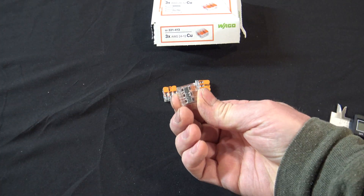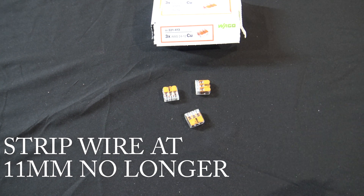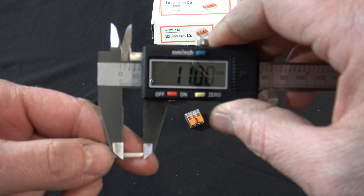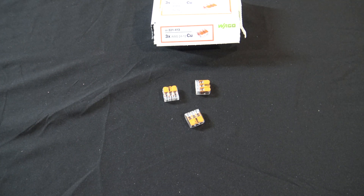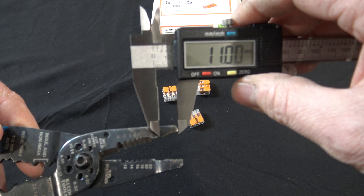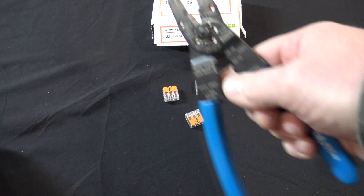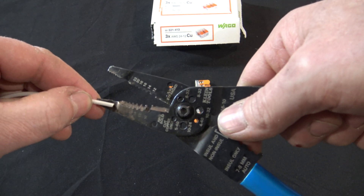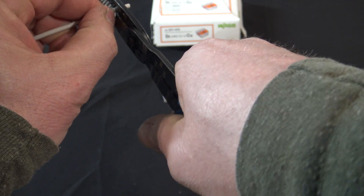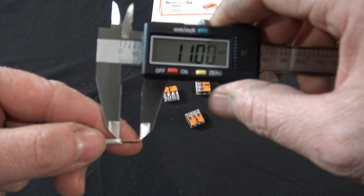One detail on these: you need to strip your wire at about 11 millimeters. Make sure you don't strip your wire too long — you can go a little bit short, but not long. Now there's what 11 millimeters looks like. If you want an easy way using your wire stripper, measure 11 millimeters — it's right there to that bend in the jaws. Take your wire, put it to that bend, put your fingernail on there, insert the wire up to your fingernail, and strip the wire off. As you can see, the wire is stripped perfectly to 11 millimeters.